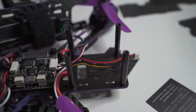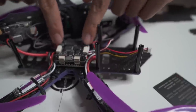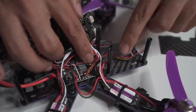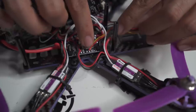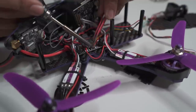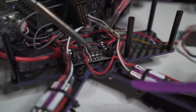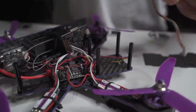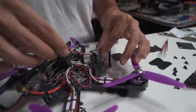Normally I'd just splice the wire and call it a day, but this Predator camera comes with an OSD — an on-screen display — that gives you voltage readout. To connect that we need to get to the PDB. This is your flight controller; take the nuts off and it lifts right off, giving access to the PDB. The camera wires run to the PDB, so undo that, take the wire harness off the new camera, and solder it straight onto the pads. Use tweezers, apply a little dab — boom, one wire done, then the next, then the signal wire.